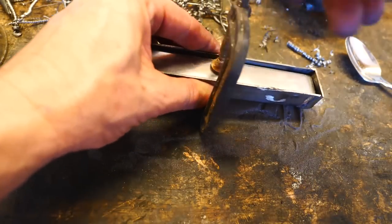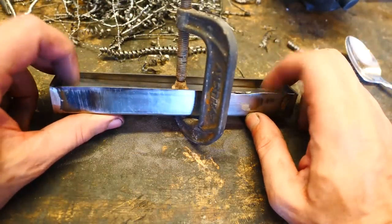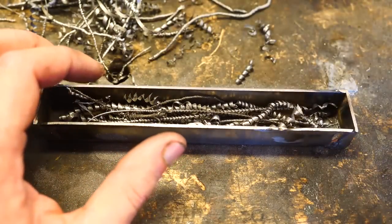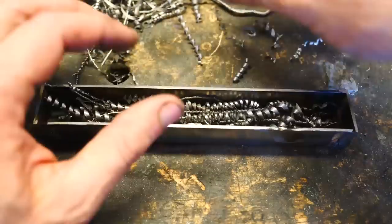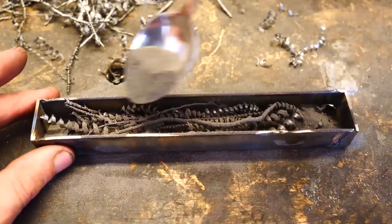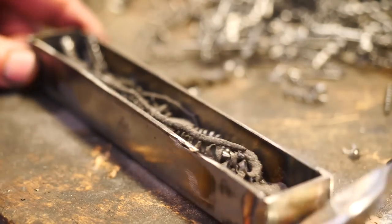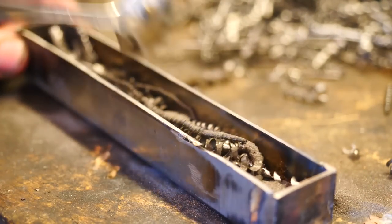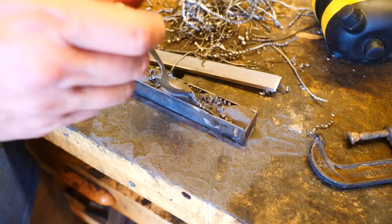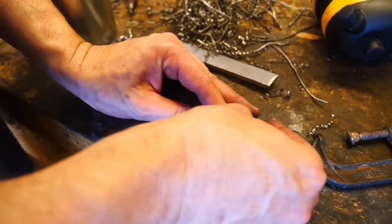But I have to abandon this as my canister really isn't wide enough and I didn't think I'd be able to fit enough spirals in it along with a solid piece of steel to make a good pattern. So we're going to go with just the powdered steel and spirals. I already have concerns about gaps, voids, and air pockets as this doesn't really seem to pack or settle very well. I'll still be able to forge weld the resulting billet to either side of a piece of solid steel in the future, but accomplishing all this in a single step inside this canister just isn't going to work.